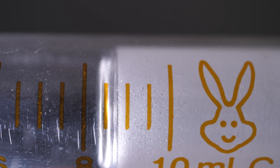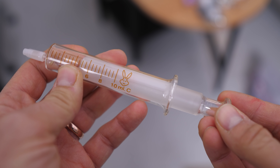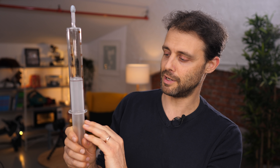If you make the plunger just slightly too wide, it won't fit. If you make it slightly too narrow, it won't be airtight. And despite those manufacturing demands, I bought this for about 15 pounds. It's really airtight, but also moves really smoothly. Isn't that amazing? So for a glass syringe to work, the plunger needs to be very slightly smaller than the barrel — only by a few microns.